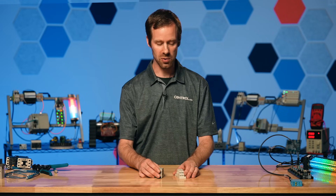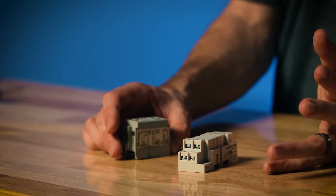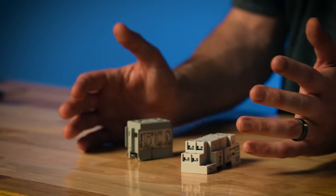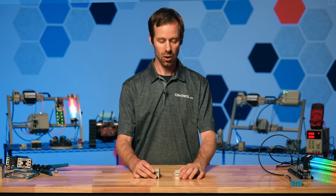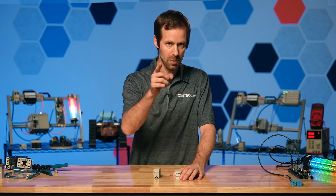So while it is still confusing, you can use these numbers to translate what status you expect — whether open or closed — when you see a relay or other terminal-based device energized or not. Back to you, Andy.